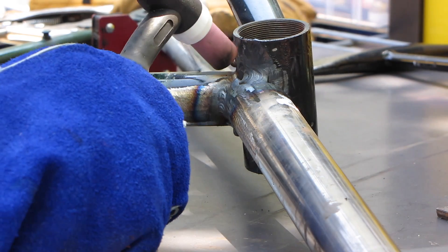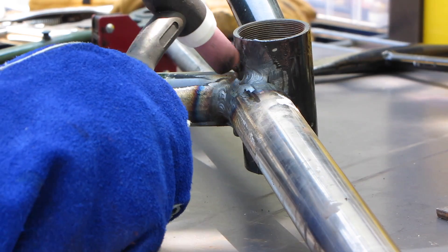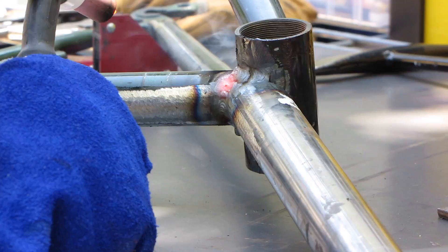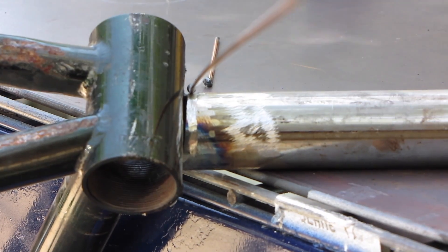You can see that I dipped the stick — there was a glob of steel on the tungsten. I did weld through it, but most of the time I re-sharpened: took the tungsten out, re-sharpened, and did it again. The weld quality was pretty good in there.